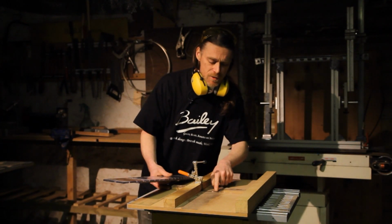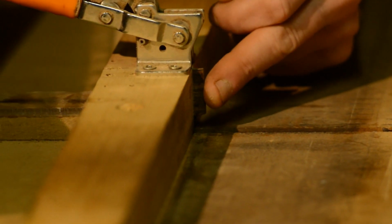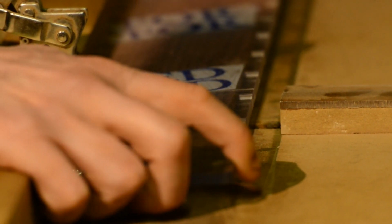The expensive bit was the saw. The actual blade itself is a special order. It has to cut exactly the right width. Mounted on the rail here is a little pin. On the fret scale pattern, there's a notch cut for every fret. So simply insert the notch and run it through the saw.